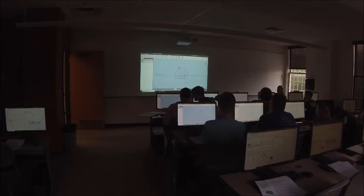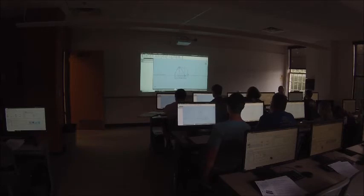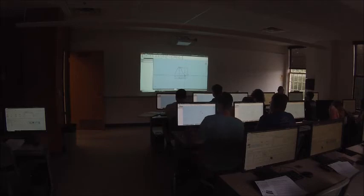We want this to be the same as this side. We want this to be kind of symmetric, because that would look pretty good. So we can do a nifty trick. We've got this line here, and this line is connected from here to here. If we constrain a vertical constraint from the center point of this line to the center of this hole, that'll force this line to be centered around this hole, which will force these two endpoints of the angled lines to be equidistant on either side. Does that make sense? Okay, so let's grab a vertical constraint, click the center of the hole, click the center point of this dotted line, and click that.